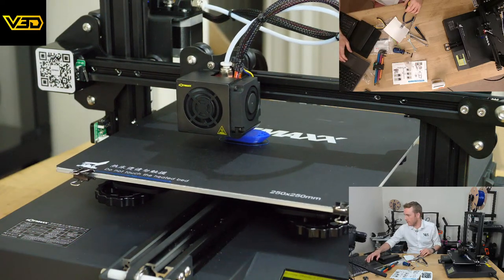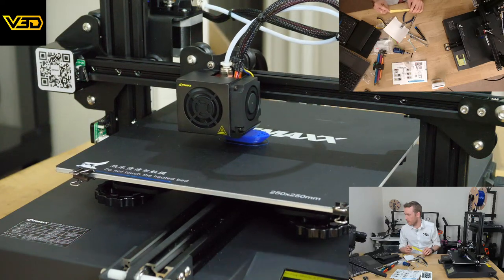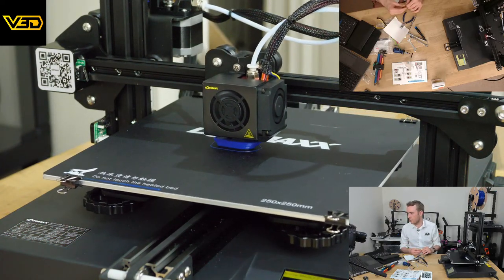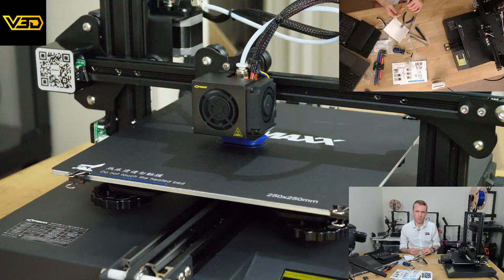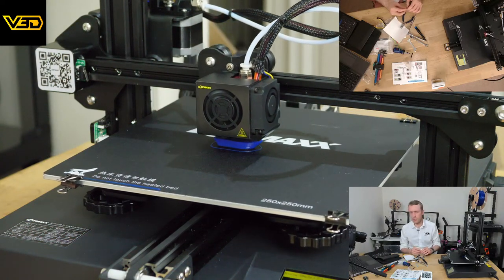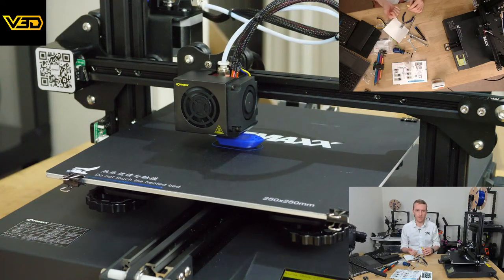I'm losing track of all the comments. In a new, not yet released printer I received, the power supply is heavily overpowered. It has plus 5, plus 12, plus 24 and 48 volt outputs and a mains power bed. Blimey. I doubt it's a power supply especially for 3D printers, because I don't know of any that use 5 volts regularly. Obviously it's used to power USB devices, but I don't think a CNC based printer would have that many different voltages. You'd normally have maybe one for the heating elements, one for the board.